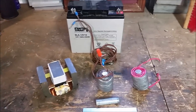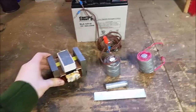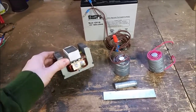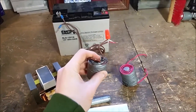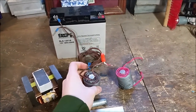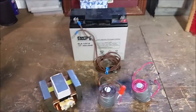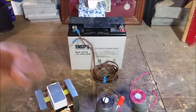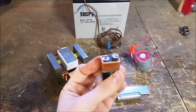Hi everybody, this is Eric and today we're going to talk about common electromagnets that you can make easily at home. We have two different types: a microwave transformer electromagnet, which is really powerful and easy to make if you have a microwave transformer, and an alternative electromagnet you can make by grabbing some wire and a steel or iron core. For a power source, you'll most likely want a big 12-volt car battery, since a 9-volt won't last long and your magnet won't be as powerful.